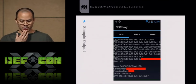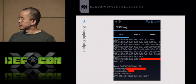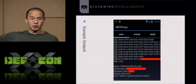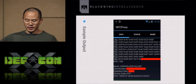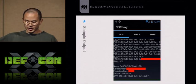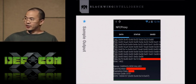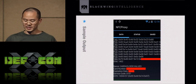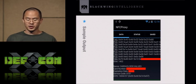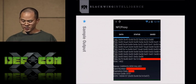Here's a screenshot of the actual tool. We have the data tab, the status tab, and the save tab. The data tab contains all your live transactions — those hex bytes are the actual APDUs sent from the tag to the PCD and back. At the bottom there's a human-readable format of the credit card information, though that's kind of a hack in the tool right now. The replay stuff should work decently well. This contains things like the service code and ICVV.